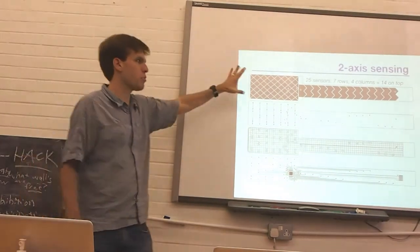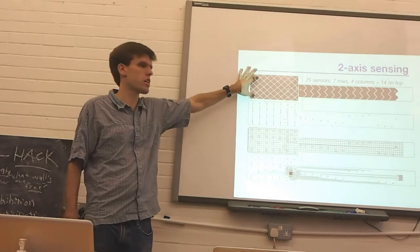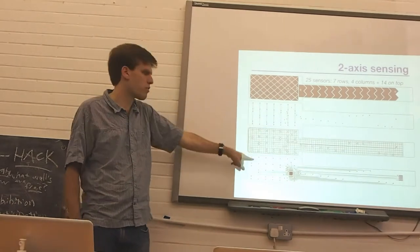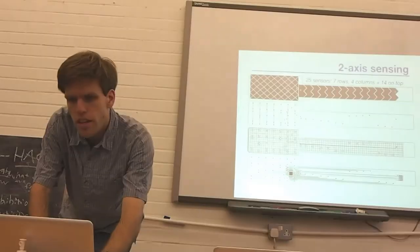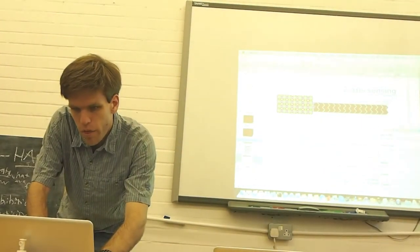This is an example of how I did this with the circuit board design. It's four layers: the sensor layer on the top, some internal connection layers in the middle, a ground plane on the other middle layer, and finally on the bottom layer is where the chip lives and the traces. I think that's as much as I'd like to say this way.